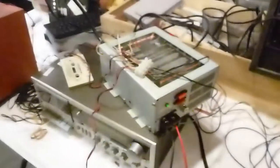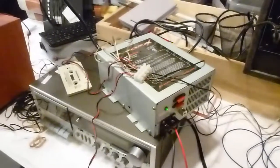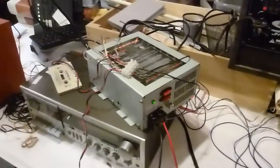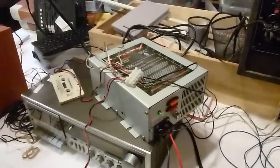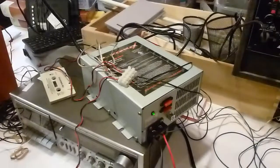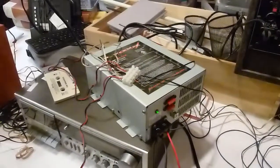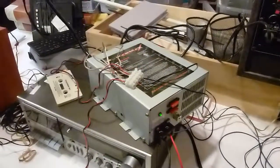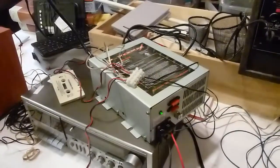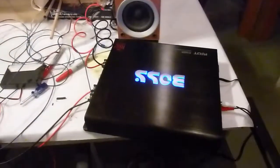And you have to have enough amps to handle whatever the amp is. So look up the power requirements of the amp to make sure that your DC is going to have enough oomph. In this case, this one's 60 amps, so it's fine. But you can't use one of those little cheapo inverters that's only got a couple amps of power, because it might be 12 volts DC, but it doesn't have enough amps to power one of these big subs. This one here is 1600 watts.